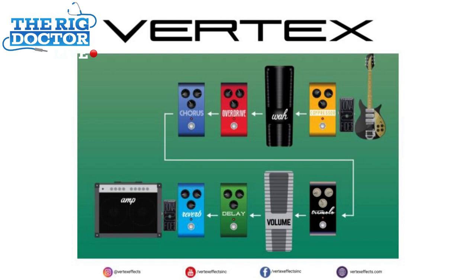So if I turn on my compressor, let's say, which is the pedal right after that input buffer, and that's mostly an always-on pedal for me, that means my buffer is only effective until any pedal's turned on or I run into another buffer. That could be a buffer in a pedal, or another dedicated buffer. If this compressor, even if it's true bypass, is on, really my input buffer is only isolating my guitar pickups, giving them the loading they expect to see, and buffering just the single patch cable that goes from it to the compressor. Everything else after that would not be buffered.